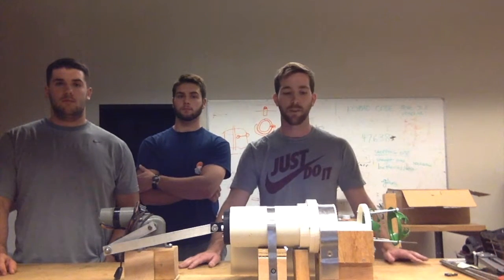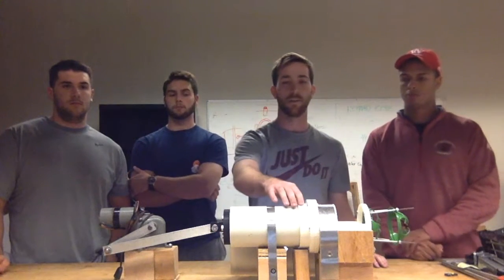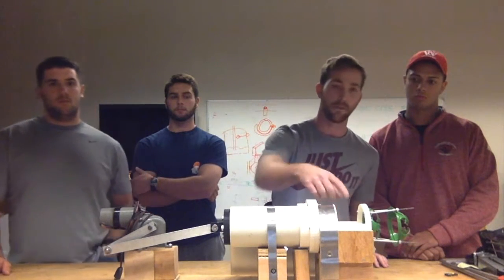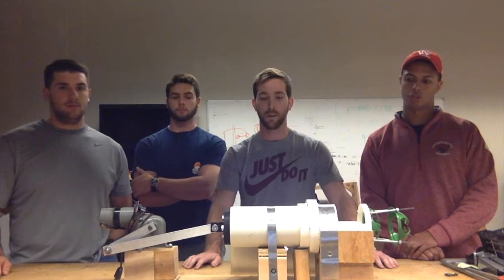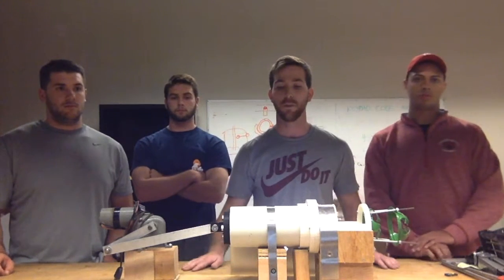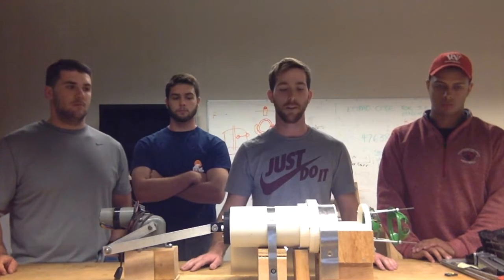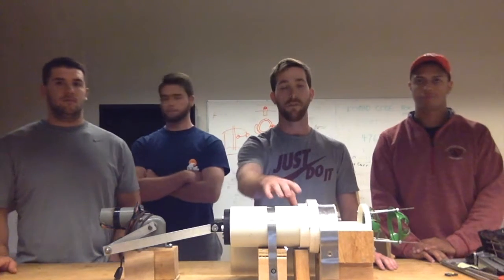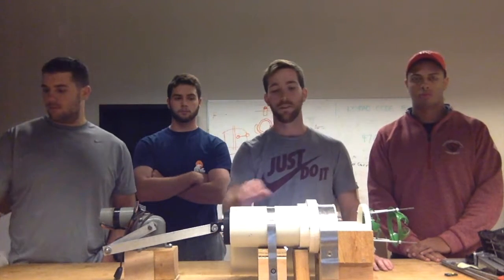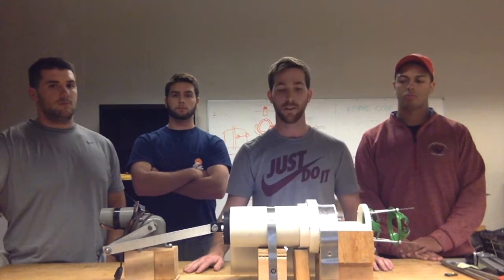Another issue with 3D printing was tolerancing. We 3D printed the black piston head and the flange that goes on the PVC pipe, as well as the shaft. To address tolerancing issues, we had to sand a few parts — we sanded the black piston head to get a smoother fit within the PVC pipe and the 3D printed part. We also sanded down the flange so we could force-fit it onto the PVC pipe. After a few minutes of sanding it proved not to be a huge issue. We did not use any adhesives to attach the flange — the force fit was sturdy enough.